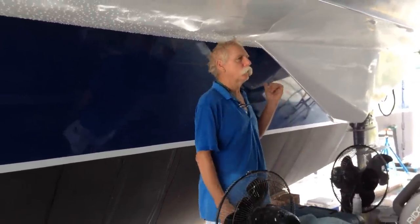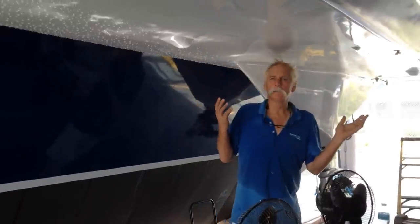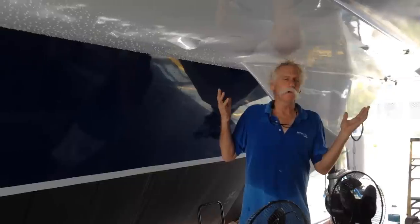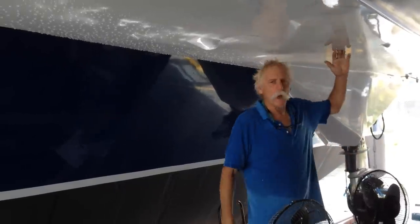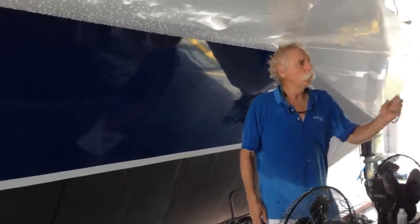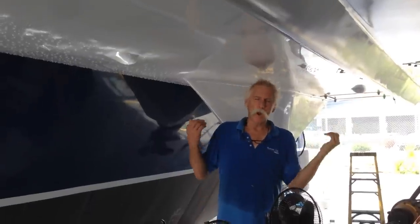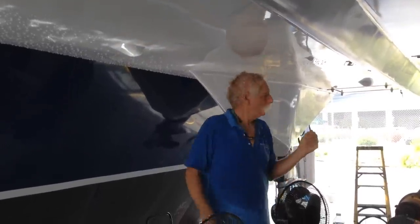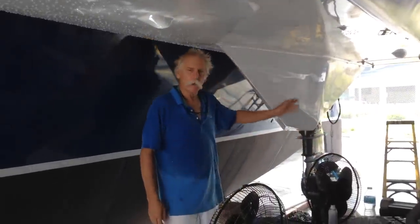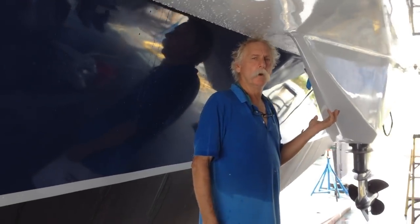We're here under the boat. You can see the bottom of the cockpit. This is the lowest area. This is where we figure our bridge deck clearance. Right now we have 29 inches from here to the water line. We're floating nice on our lines. We have the spine here to deflect seas, kind of break their impact a little bit. We have nice fairings on the outboard pods, again to deflect water.